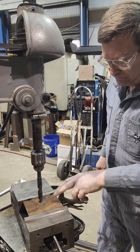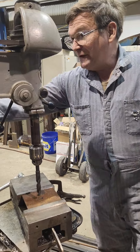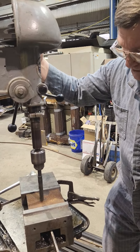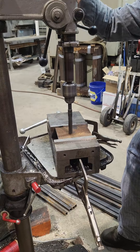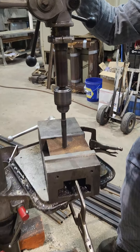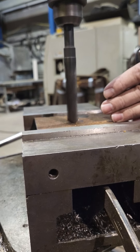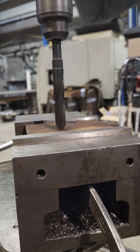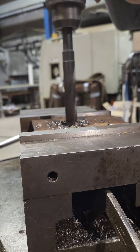Now another thing — with a 5/8 inch drill bit, not going on a center punch mark, not going to center drill it, but what you can do to kind of cheat the situation: turn the speed up way high like you would for a little bit, and just dance a little bit right on that point. It's not ideal, but you can get it to where it will pick up. I can still see it's going to one side, so I need to be patient enough to dance with it until it's not deflecting before I turn down the speed and go for a regular drill. Not something you do all the time, but there are occasions when you want to do that.